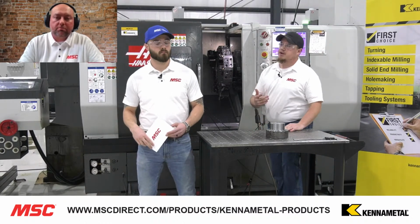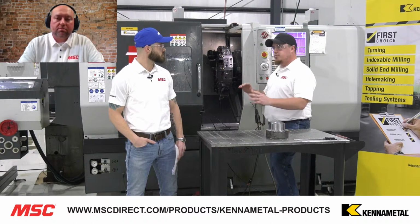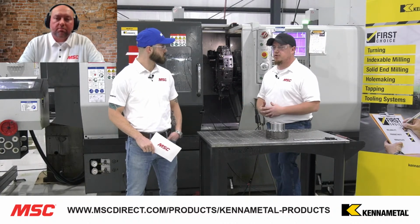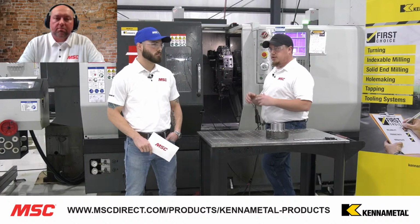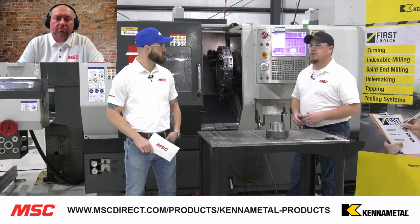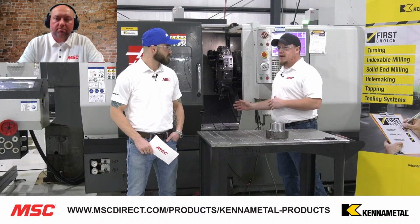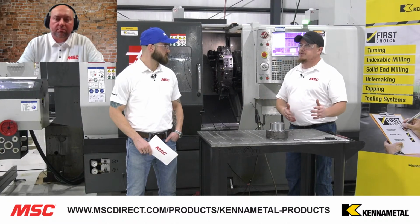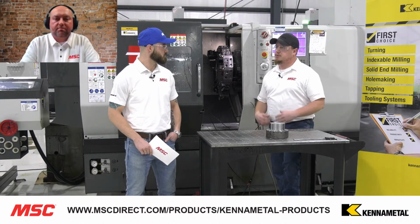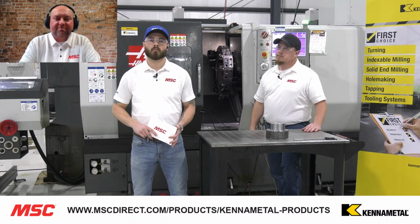Yeah, so something else with creating capacity I wanted to mention, because the viewers aren't going to be able to see it here at the control: with the old school method that we were running with those safe parameters, I was only running at about 30 to 40% on my spindle load. Then we get into that second part with the new school method, really creating that capacity, and I'm up into the 70 to 90% spindle load. So with that old school method, my machine has a lot more to give. There's way more capacity inside this machine. So jumping into the newer tooling and really pushing that part, we're using up more of the machine's capability to create that capacity. Absolutely. You've got a machine, why not use it?